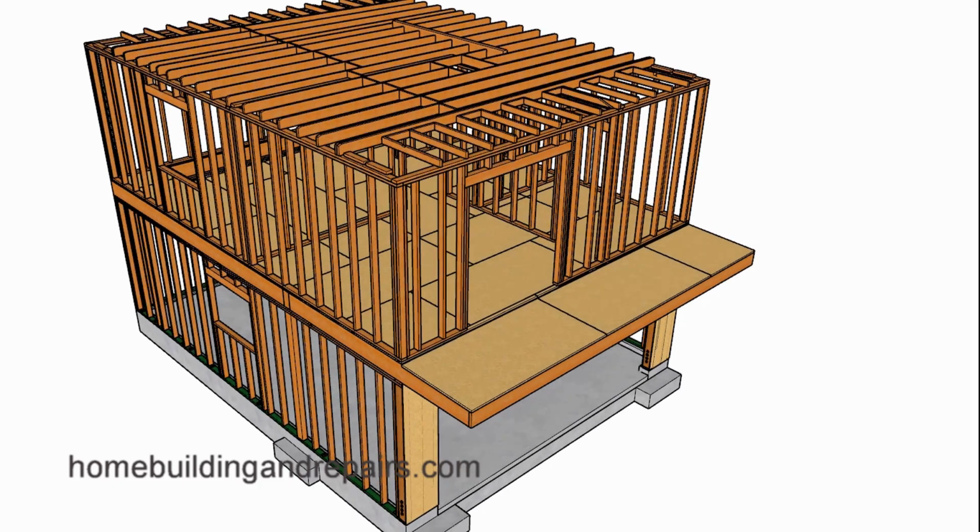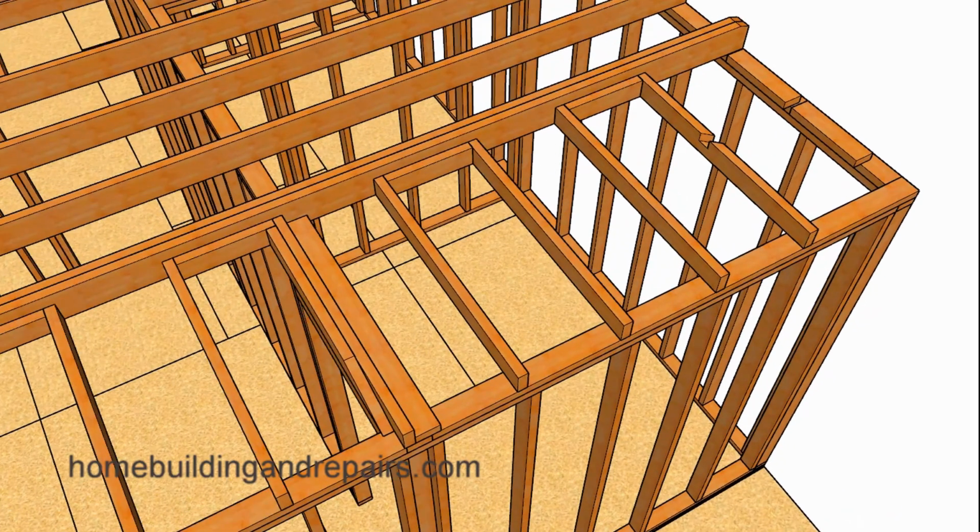And if our ceiling joist looks complicated, that's because of our hip roof. And if you watch some of our other videos, you might have noticed where I used pressure blocks instead of joist hangers. And since the span here isn't very long, we can use 2x4s and butt them into a double 2x6. And then of course we are going to need to notch underneath the hip rafter.